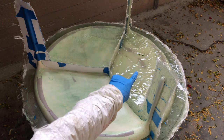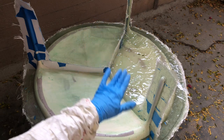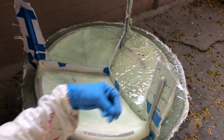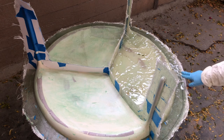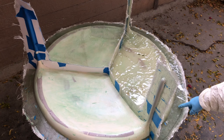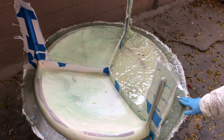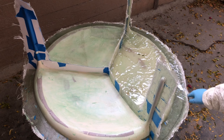On this section, I have done all of my layers as well as the top wax coat, which will cure all the layers underneath. I've preemptively drawn a line where I will cut off the edges so that everything is smooth, as well as marked where I will drill the holes so that I can bolt everything together when making the side table or when it's in storage.